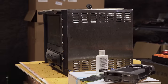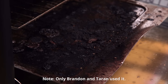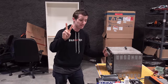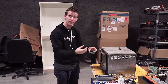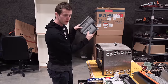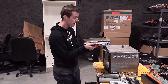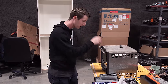Let's run through what we got here. We have a Wolfgang Puck oven generously donated by Luke to Linus Media Group, because LMG's employees made it so filthy and disgusting that he pretty much doesn't want it anymore. It's important to use an oven that can reach 385 degrees Fahrenheit and that you never intend to cook food in ever again, because there can be gases and materials let off that can contaminate future food. We'll also need screwdrivers, aluminum foil to wrap the tray and separate the PCB from it, and replacement thermal compound for reassembly.